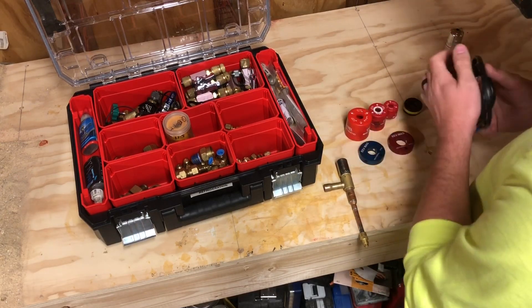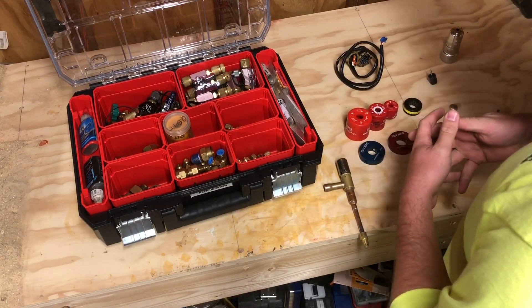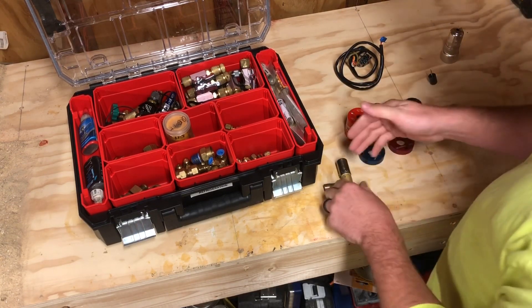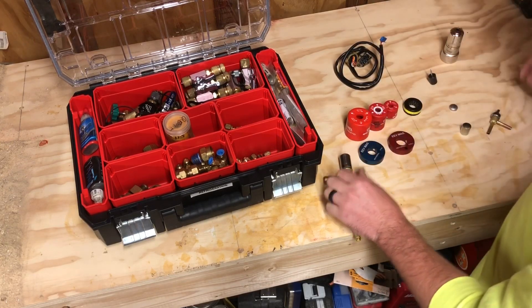On the larger valve bodies, the battery terminal brush is not going to work — you'll have to use something different like a Scotch-Brite pad, steel wool, or something similar. Once you get everything cleaned up, put a thin film of 3-in-1 oil on each component — on your valve body and on the inside of the coil — to help inhibit rust.